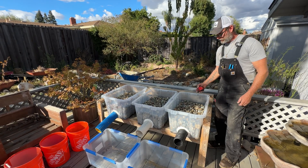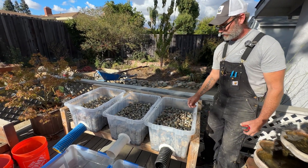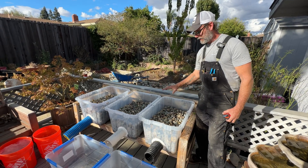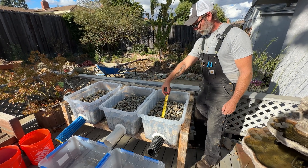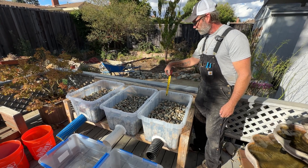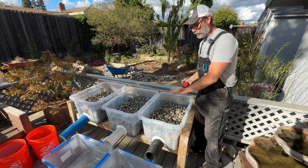What we have here is standard inch and a half clean gravel. We washed it all equal — equal heights, equal containers — and we ran equal lengths of pipe with a cap on the end of each one. The only water that can penetrate the tile is straight through the holes. We set these up with caps on the end; each pipe runs the full length of the container and has a cap siliconed on the end. So the only water can go through the holes.